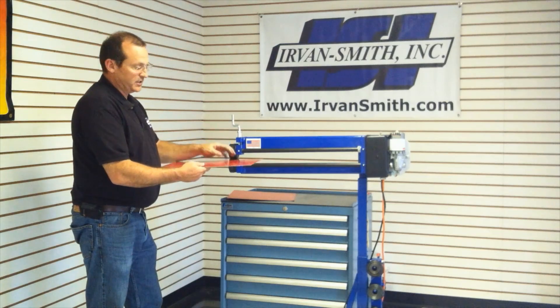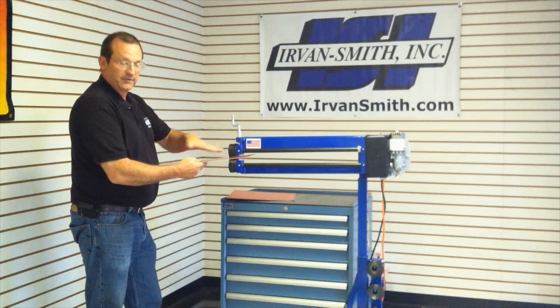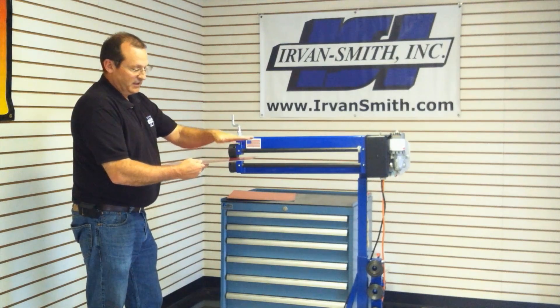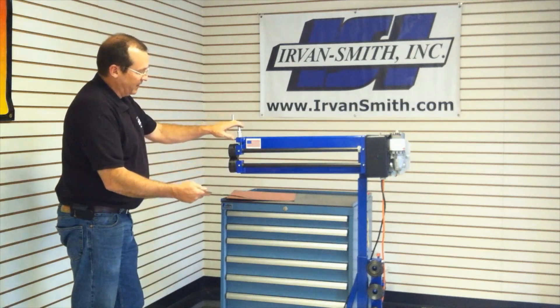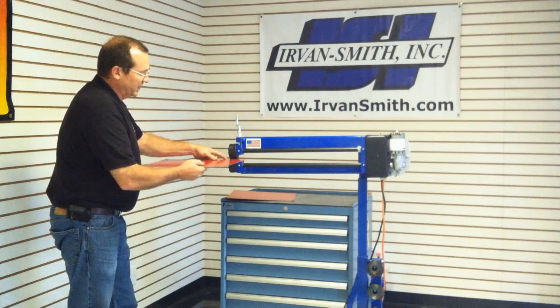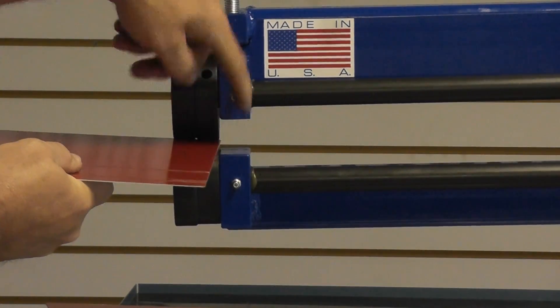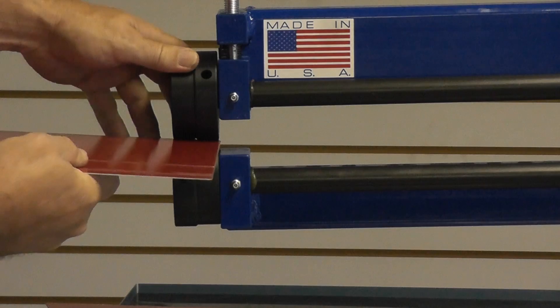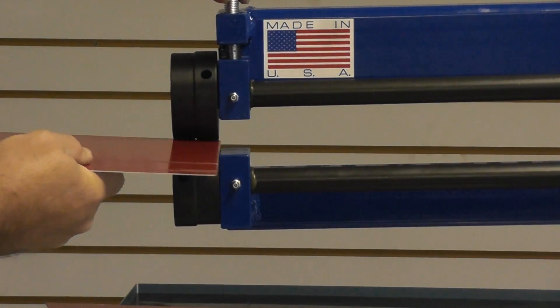But for this demonstration, we're going to put it right down the edge where we're going to lay another panel on top of it — more of a flush fit instead of having that panel just rest right on top of this panel here. Got the mandrels pulled down snug against each other; you have to force it in there just a little bit. I use the edge of the wheel as a guide to keep my step as consistent as I can as far as how wide my step is.